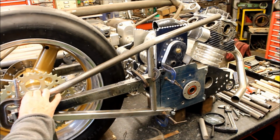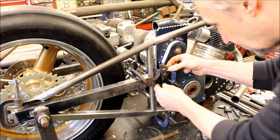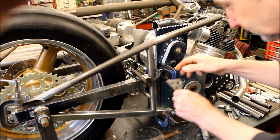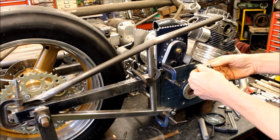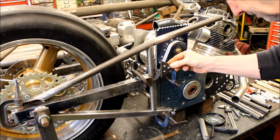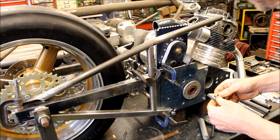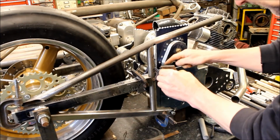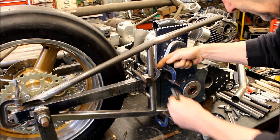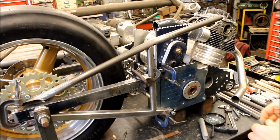Okay, so if I, like you say, where's me? These are a couple of lugs. When them lugs are in there... Oh, there are your lugs for the frame. Let me just zoom in a little bit. I've got a radius on. I've just drilled them. Yeah. When they're welded on, I can make a piece to mount from there. I can put a screw in it there and have it there. So if it comes up, I can then run a spacer across to join a piece of plate there.